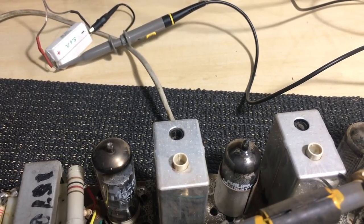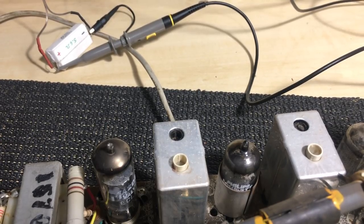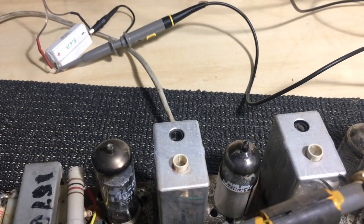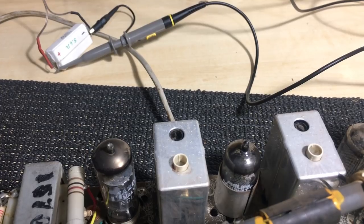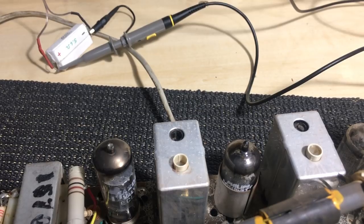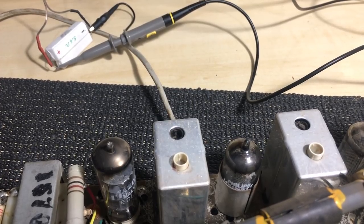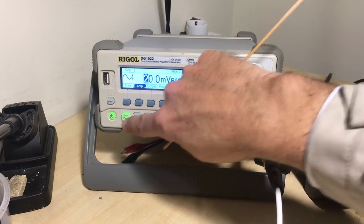We're actually tuning an FM receiver. And so fidelity will depend on how good my signal is coming out of the speakers, right? So what I do is I put the scope across a dummy load, in this case, so I don't hear it. But the scope is across the dummy load. And I'm going to input a carrier signal of 10.7 megahertz, FM modulated with a 600 hertz audio tone. And I'm going to look at the scope and see what that tone looks like and adjust that core for the best fidelity. So I've got my 10.7 megahertz.